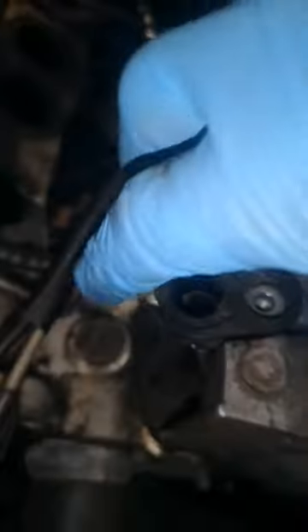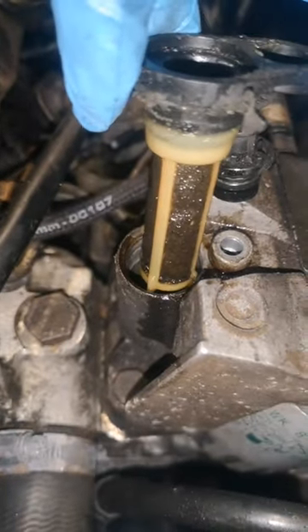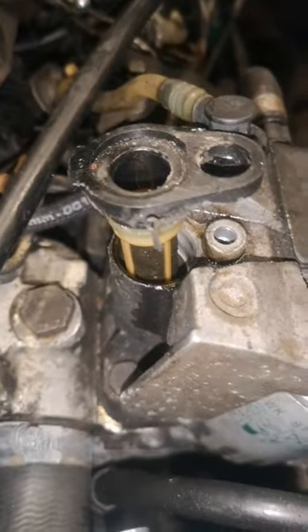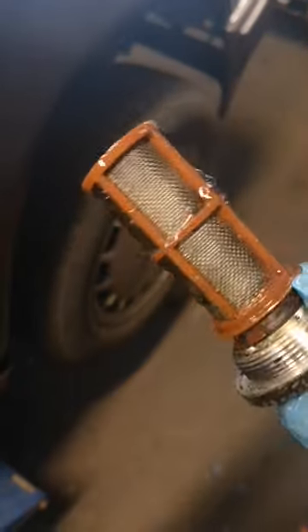This is the diesel pre-filter. Firstly, the silicone where the o-ring should be, and there's a lot of debris or gunk on this filter — this will cause quite a bit of resistance. The first thing to do is clean that, and we did that with compressed air.